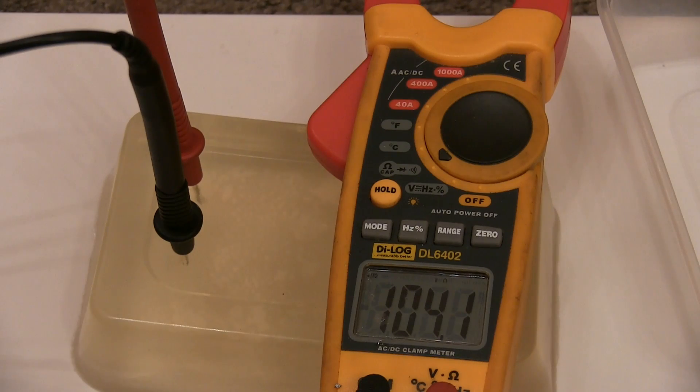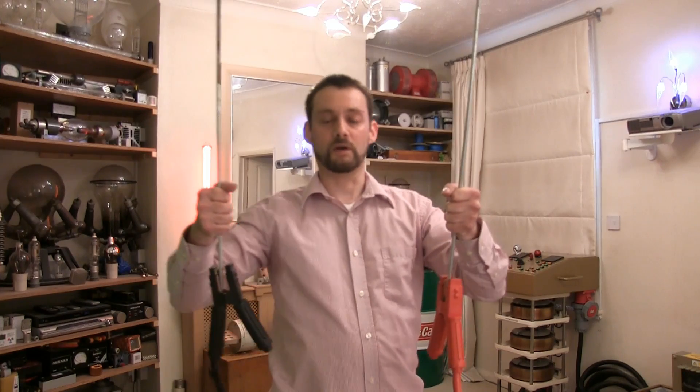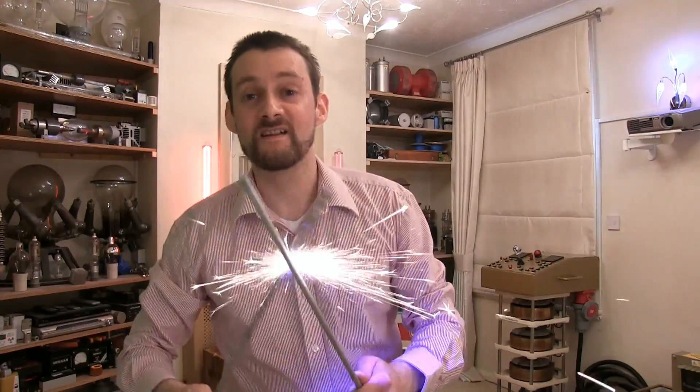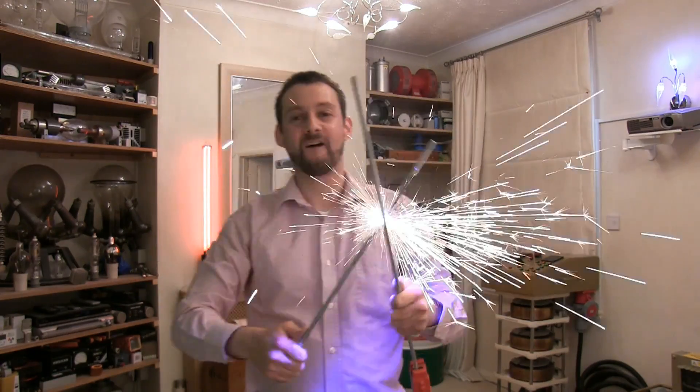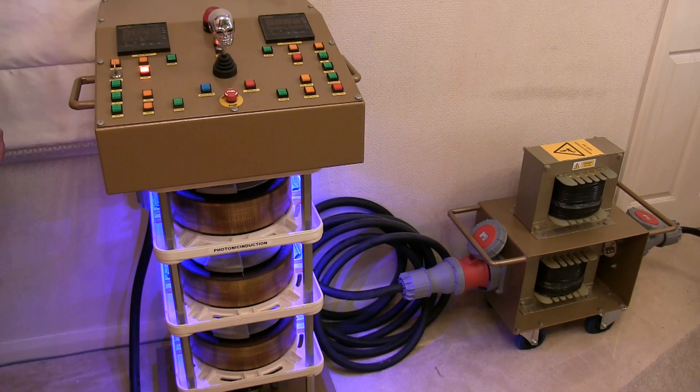You can see that is 100 kilo ohms. On these two probes there's a capacity of 300 amps available and I'm holding the metal probes, but because it's extra low voltage — ELV — I can't feel it. So it's getting warm. To check the breakdown voltage of this ballistic gel, which should be pretty similar to the resistance of human flesh, we're going to use this power supply which can give us up to 500 volts.